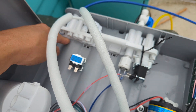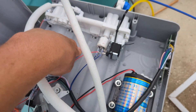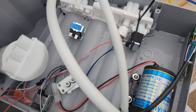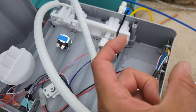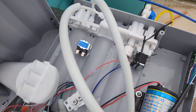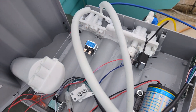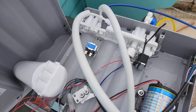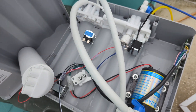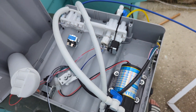There is also a valve here so the water flows into the system through a low-pressure pre-filter, then through this valve before going into the pump and into the membrane saver — I think they refer to it as a carbon filter — which goes before the reverse osmosis membrane to keep anything too big out. As soon as you unplug the system there's really no possibility it can leak, but it does not have a leak sensor, which would be a really nice feature to have if something like this were to happen.